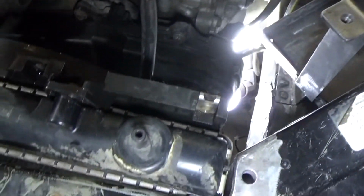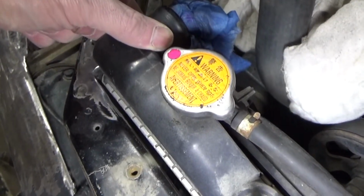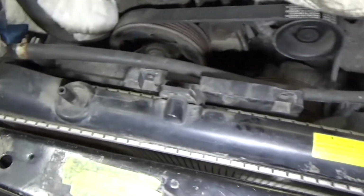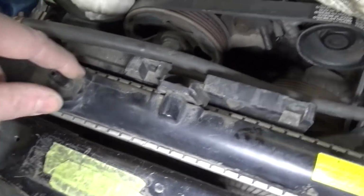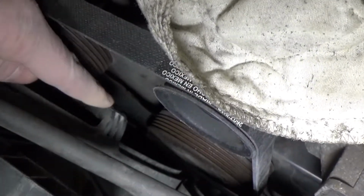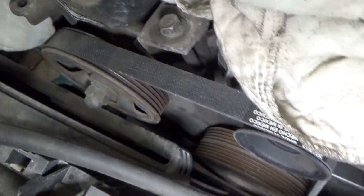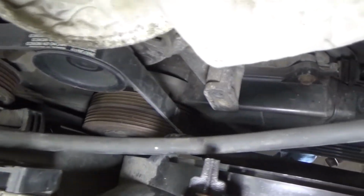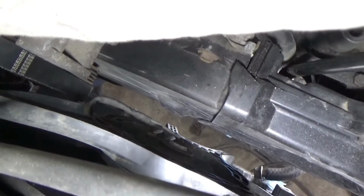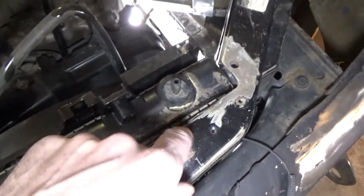It's down on the rubbers on the bottom and everything right now. And when I hold it in here, this is about where it's supposed to sit, and this radiator actually, not surprisingly, has a bit of a twist to it. But when we get the mounts in, it will hold it square. And it's really close to the belt down there. In fact, it's pretty well touching it. But the plastic where it's touching isn't vital. It's not a supporting piece or anything, so I can just carve it off of there in clearance for the belt. And then there's a wire down there that's a little close, but I can strap it back and that'll all be fine. So we're going to go ahead and get these upper mounts in.